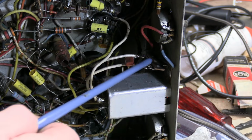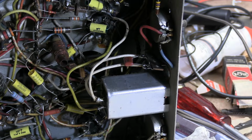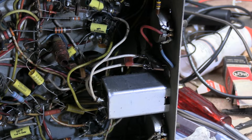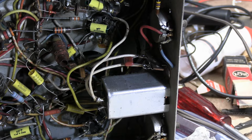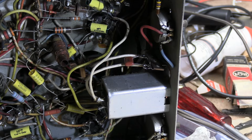They actually have it on a separate little terminal strip just for one capacitor. Again, I used a film cap. Often those are mica. You might want to use mica or C0G because you don't want that frequency to drift. I used film because that's what I had on hand, and it's kind of a large value in this set. I believe that was a 0.015. So a 15,000 picofarad mica cap could be a little expensive, and C0G ceramic at that high a value might be a little tough to get as well. So use film if you have to, but ideally that would be something even better.